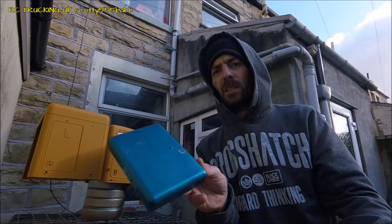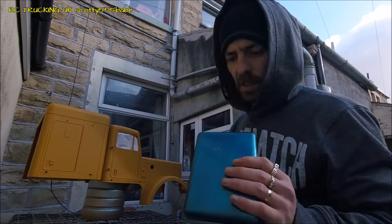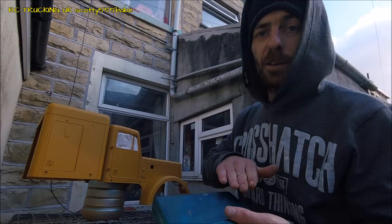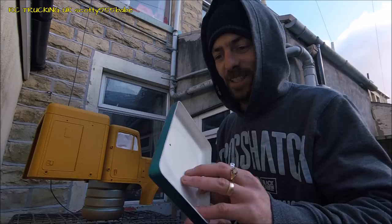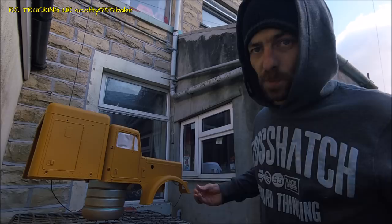It's been quite well baked, and yeah, it could do with a few more days, but I get the gist with it, nothing's reacted. So all I'm going to do is strip this down with the graffiti remover, so we'll see if the graffiti remover can eat 4 coats of different paints, whereas on this it was just the one paint which had been on for god knows how many years. And then I'll try out something else, but it's a good way to experiment and you guys get a feel for bits and bats as well. So let's get this primed.